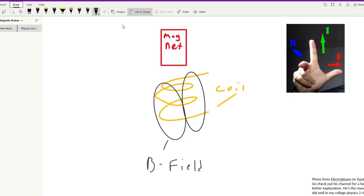When a current passes through a conductor, it creates a force whose direction is determined using the right-hand rule. It's the opposite of what we just talked about, and it's how basic motors work. For eddy currents, they create a force opposite to the direction of travel that created them. That's the braking force.